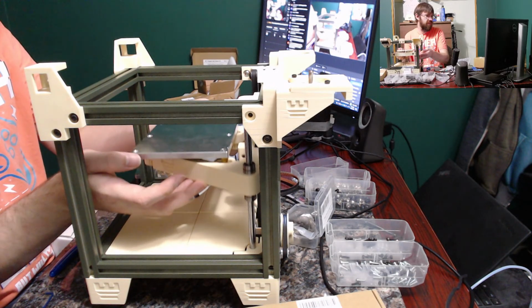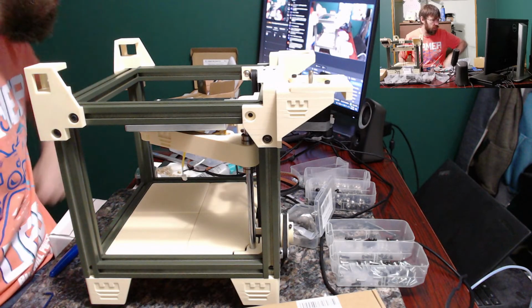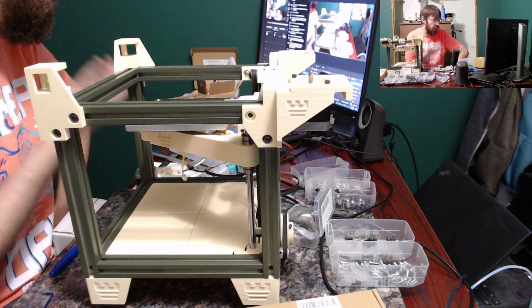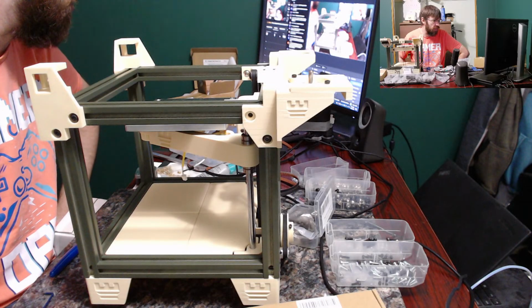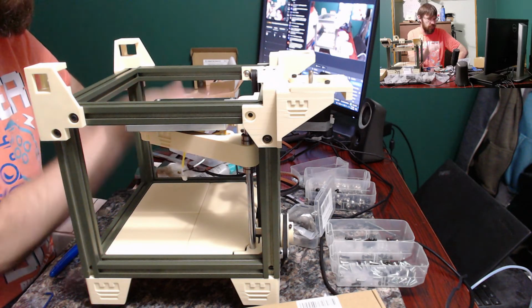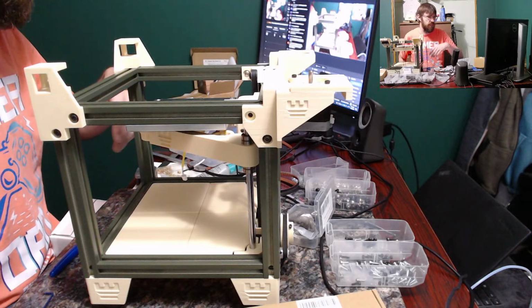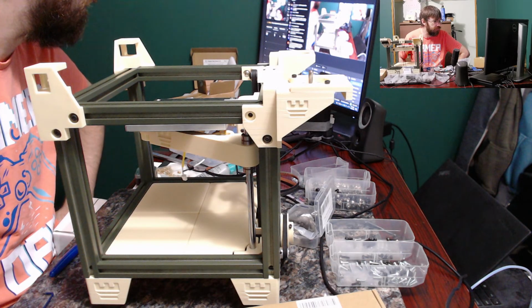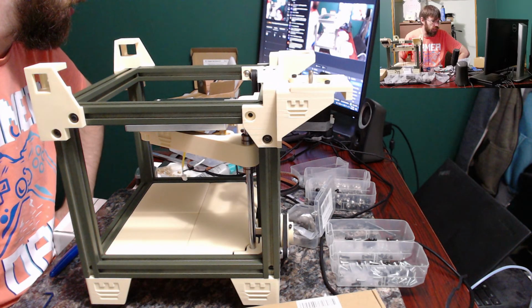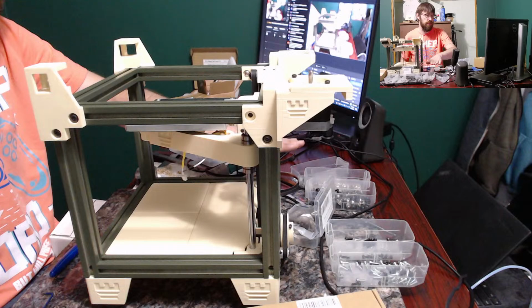My Z is very, very free moving, so it does move very easily, but yeah, the 4-to-1 gear reduction certainly helps quite a bit. And also, Jaff J, you can just make sure your bed goes to the bottom when it finishes. You don't want to have your printer finish printing and then not dock the bed at the bottom. So I had an end print macro set up. So when my printer was done printing, it would lower the bed all the way down to Z max. So yeah, your bed should never be falling when your printer is working properly. It should finish the print and the bed should just lower down to the bottom, and then your printer should shut off.